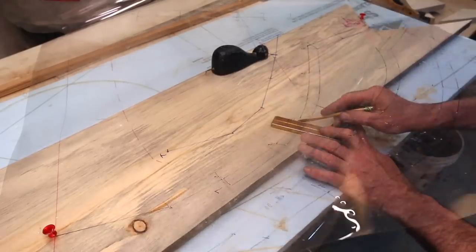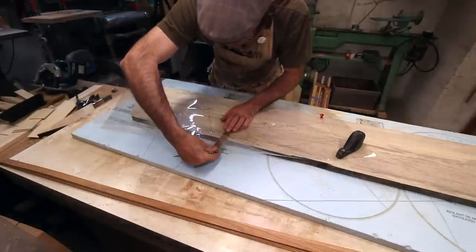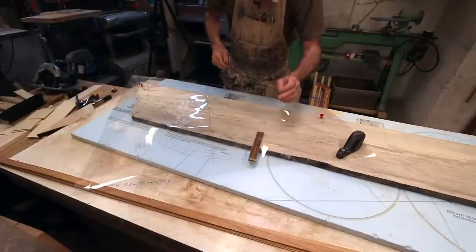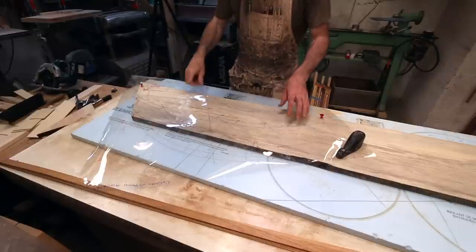I'm just drawing in the plank lines and throwing in the attitudes of them just to make it easier to see. I'm not going to bevel these molds — I'm just going to leave them square-edged. We'll let the battens bear hard in the corner, and if that's being problematic I could glue a little block or a wedge in there, or come along with a hot glue gun and blob in a backing for the ribband. We're going to be building this boat using a batten-on-mold, which means we're going to be using stringers or rib bands placed at each of the plank laps along the length of the boat.